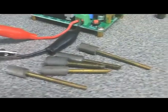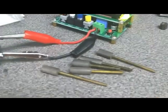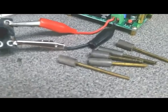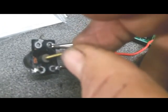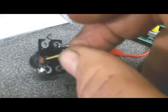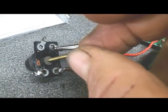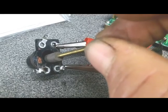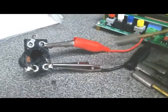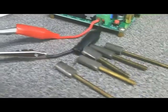And in my box of tunable inductors, I found a bunch of tunable slugs, and I've been trying them. If I just lay this slug inside of here or move it in and out, maximum inductance is about 119 microhenries, and it comes out as low as 83, which pretty well mimics what one of the original slugs was. So I've got a bunch of them here.